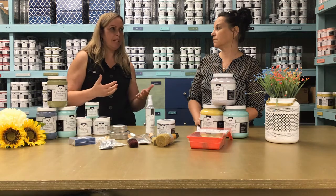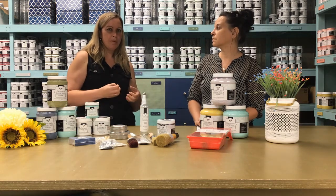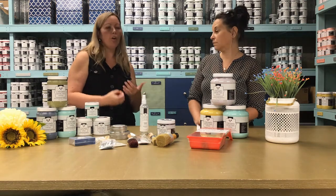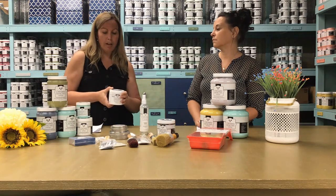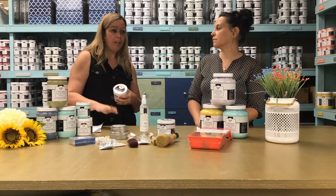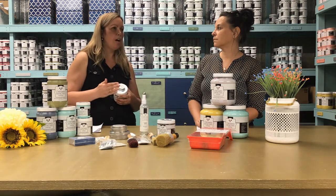If it's water based, you don't really need anything more than light sanding or a bit of cleaner sprayed on the surface. But sometimes when it has an oil-based varnish or paint, it won't come off on the sponge or cotton ball. That means you really need our oil-based primer on the surface before applying paint, because after a couple of months the paint will come off.